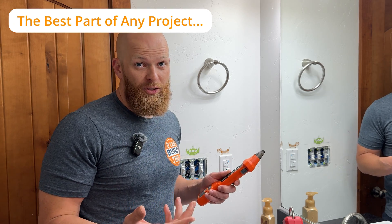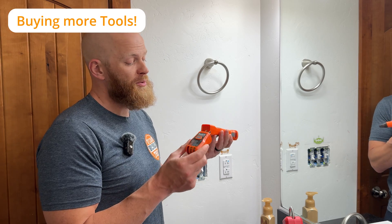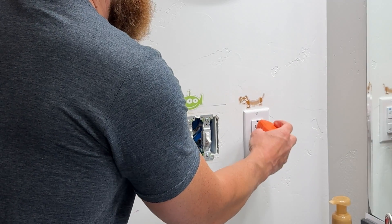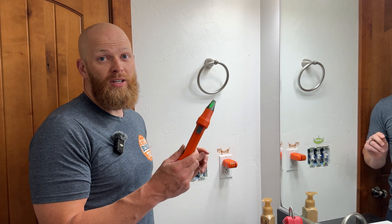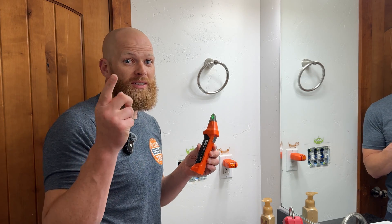Because of where we live, our bathroom is on one breaker — I know that for sure, I just don't know which breaker it is. So you take the bottom half of this tool, it plugs into the receiver, and you just plug it into your outlet and turn it on. It's going to beep, and when we get to the breaker it will give a different audible signal to tell us which breaker it is. When we turn off that breaker, these lights should turn off. So with that plugged in, we're going to use the receiver and go to the breaker panel.